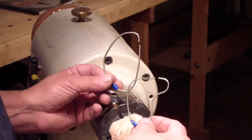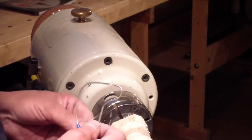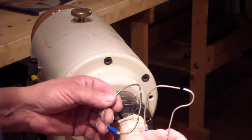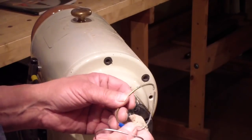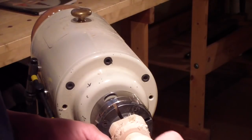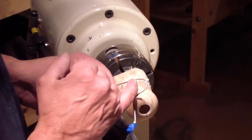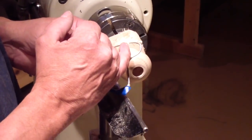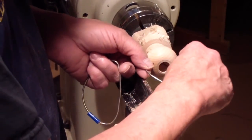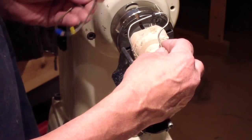Terry Brown's the one that sort of showed me these shapes, and I taught a class here at the Craft Center, and we made our own gauges, and then somebody walked away with my prototypes. So I had to go back to Terry and figure out how to make them again. And I've almost got them right. This one's supposed to be a little bit more elongated, but this one with a bent crooked thing will do the top part to the middle, and it's spring loaded. You set that gap about where you want it. I set it about a 32nd wider than I want it, and right now this globe is exactly that thick. It's too thick for me, but I'm not going to waste your time hollowing anymore.